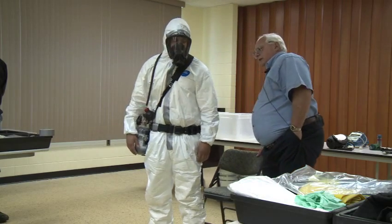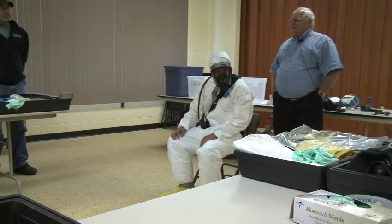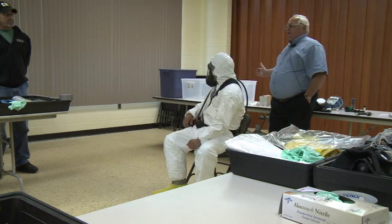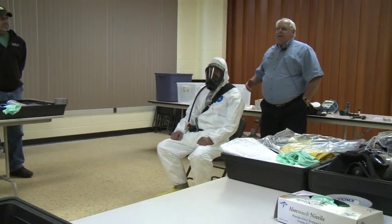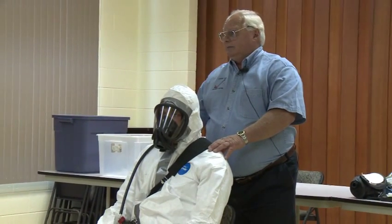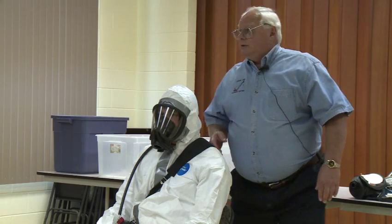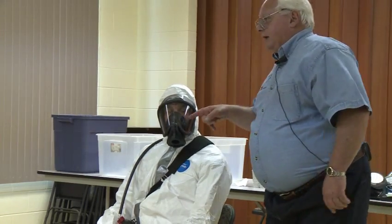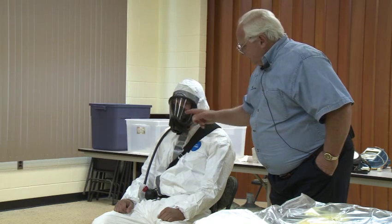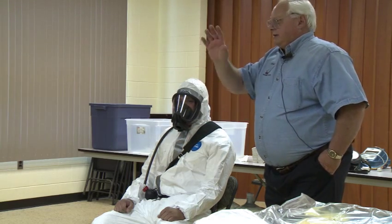What I want him to do is sit in the seat here, just like he's going to be in a machine, and before he backs up and puts it in reverse, he has to look behind him. So go ahead and look behind you like you would normally look. You've got to go way around, don't you? Peripheral vision isn't very good. Keep in mind the bigger you are, the heavier you are, the smaller the machine. Try doing what he's doing in a skid steer — not real good. Do they use skid steers in hazmat? Yes — they handle drums, they do a little bit of everything. Your vision is cut down. He's looking down — isn't that a pain in the neck? Because you're looking down, he's seeing the nose cup, he's seeing this.